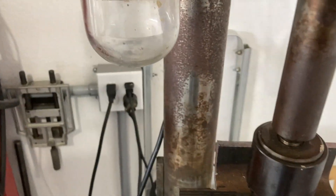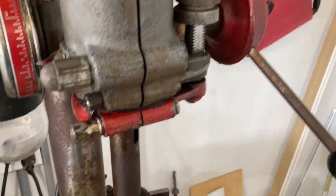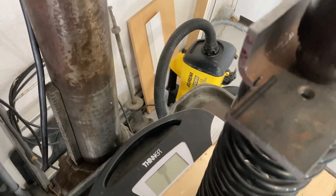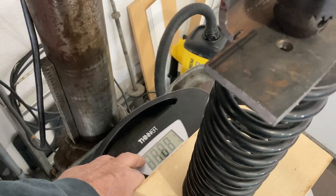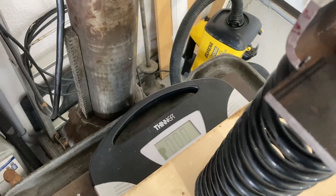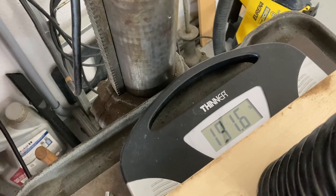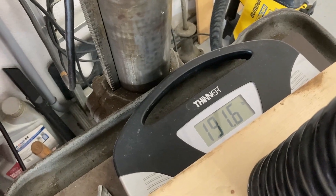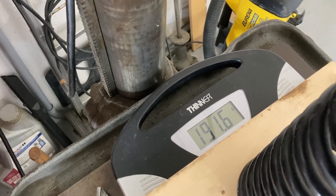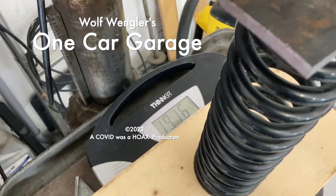So now when I pull down on the drill press, I'm going to put pressure on the spring. You see how this goes here. Start the scale up, and one inch — pressure reads 191.6 pounds. So probably a 200-pound spring that's lost about five percent or so. And that's the way you do it.